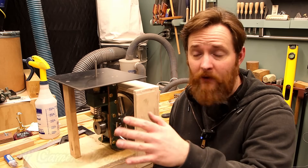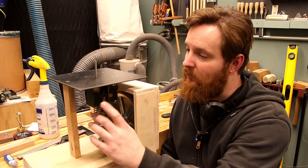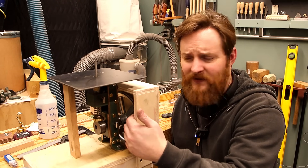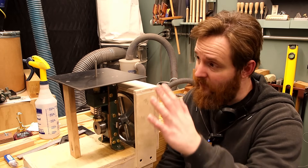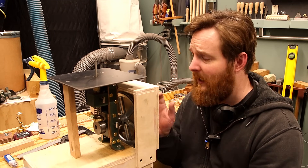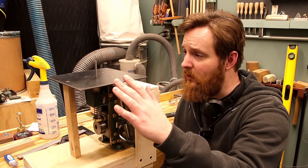A rider, I guess is what it's called. There was a little bit of a gap between that and the cam — I had to adjust that so the whole thing runs a lot smoother now. I went ahead and put a bigger wheel on it. I had a three inch on here; I went ahead and put a seven inch. That's about as big as I can get in this box. That slowed it way down and I think it's at a pretty good speed right now. Then I went ahead and built a quick and dirty cover for this just to keep from accidentally getting caught up in that wheel. I've got a temporary support here to help keep all of this sturdy.